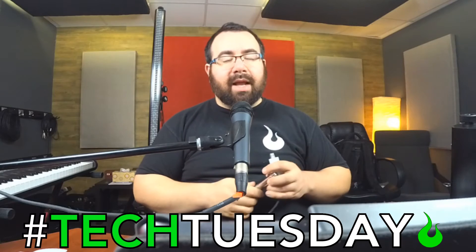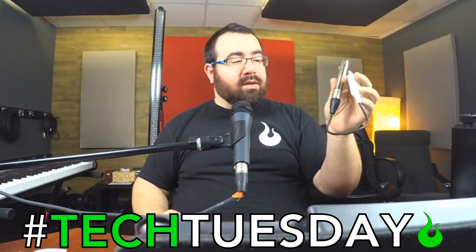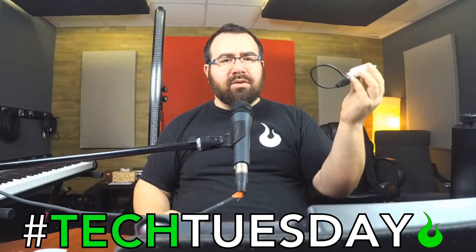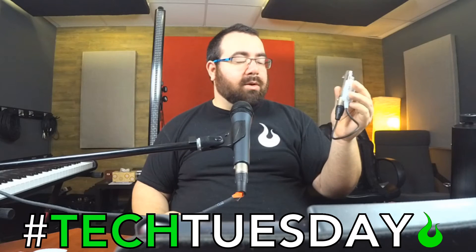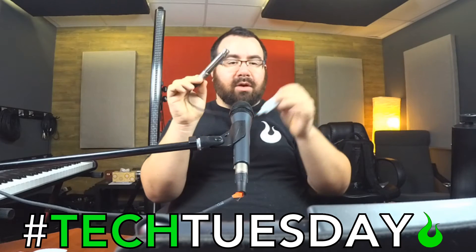You're going to need some sort of way, if you don't have a lighting controller, to connect to your lights. What we'll be using today is the ChamSys MagicQ dongle. This is very affordable — it's about $100 US. There is a $15 version as well, but it will only work for about five hours at a time before it makes you restart it, so it's worth just going ahead and buying the $100 version. You can use pretty much anything — it doesn't have to be this one, but this is a great way to start. The software is actually free, which is what we'll be using today. It's called ChamSys MagicQ. We're going to use a very simplified version of it. This particular dongle is 5-pin DMX.